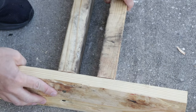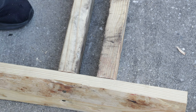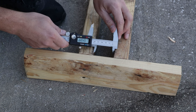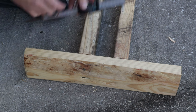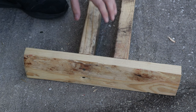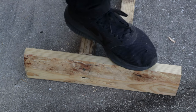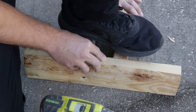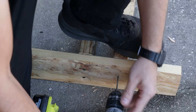The next one is more important because that's where the sizing of the actual gap comes in, so I need to be more careful with the drilling and nailing to get it in the right place. I'm using my reference to get this as accurate as I can — it was about 54 millimeters on the other one, so I'll make this one about 54 as well. I'll put my foot on it again and do my pilot holes on this end too, then go ahead and nail it in place.